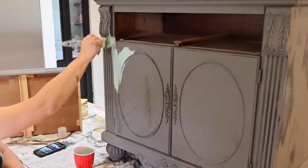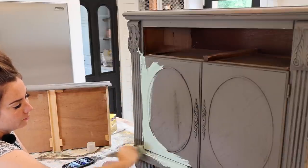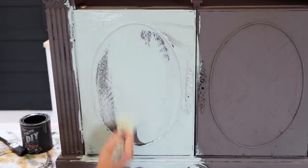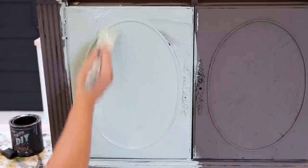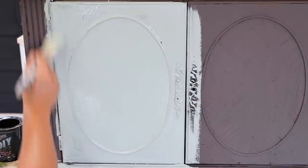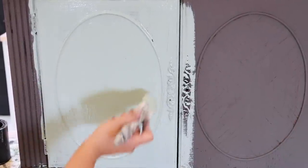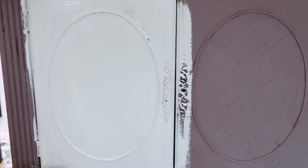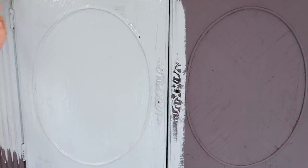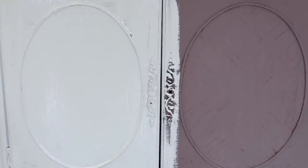I'm going to come over the top of this Weathered Wood and paint it with our secondary color, then we'll do a wet distress and bring back that Weathered Wood color and get it to chip a little bit. The milk paint is a lot thinner — you can see it's dripping. The nice thing is it lays pretty flat, and especially if you sand it, you can get it buttery smooth. You can go through the milk paint to the base texture of the clay paint below and it gives you a good layered finish. Most old pieces have been painted multiple times, so we like to incorporate lots of colors — natural wood, milk paint, and clay paint — for a really nice aged look.